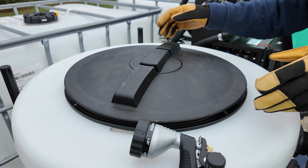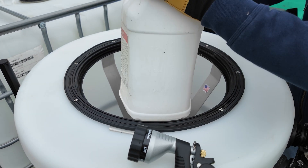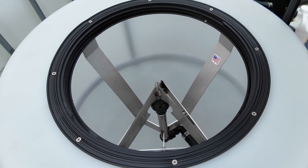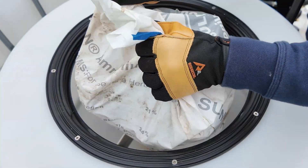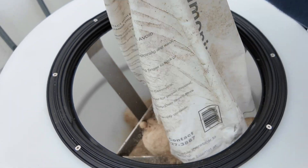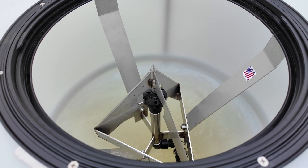If chemical powders are required, open the swirl rinse and pour the product into the cone tank. We'll be inducting 5 pounds of powdered AMS. Even if no powders are required, it's a good idea to run the swirl rinse for a few seconds between each chemical and again before closing the valve at the base of the cone tank.